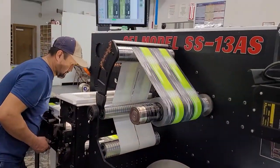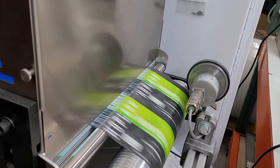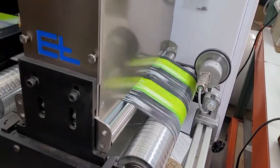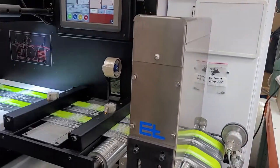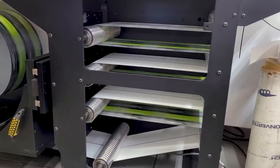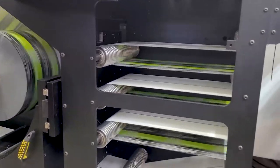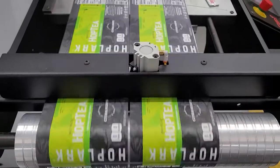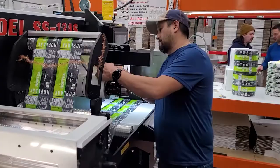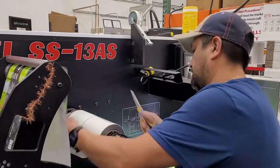It comes up here, and we see it on this screen, and it'll tell us if the label passes the QC or if it fails. So we're going to calibrate — it's going to go through this camera and take an iteration of labels and take a standard print off of those. It gives us a master file, and that master file is used to sample against everything else on the run. So when we run your labels, you can be confident there won't be a defect on any of the labels coming through onto your product, saving you a lot of hassle dealing with bad labels.